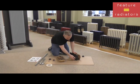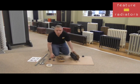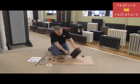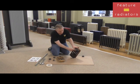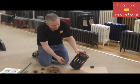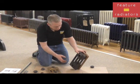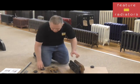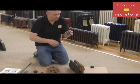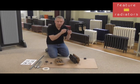Now let's make the join. A couple of things to remember: make sure the faces you're going to be joining are clean. If they look not quite clean, go over them with a light abrasive. Because you've got the gasket in the middle of the nipple, you don't need to use PTFE tape or any sort of paste — the gasket will give you the seal.